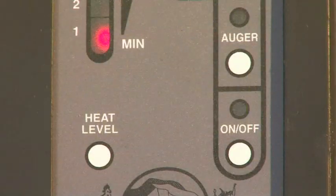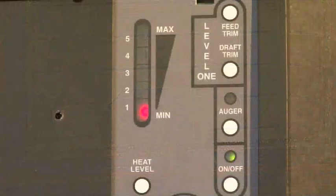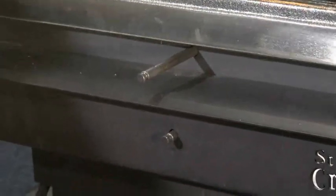After five minutes, the control board automatically checks for proof of fire and starts feeding fuel into the burn pot. If it fails to sense the proof of fire, the stove will continue feeding fuel at a low setting for another five minutes and check again. If the control board fails to get a fire indication a second time, it will go into safety shutdown and the third LED light will begin to flash. If this happens, check that all doors are latched, the hopper has fuel, and the coal rake is pulled out and the slide-out bottom is pushed in. Then repeat the steps of lighting the stove.